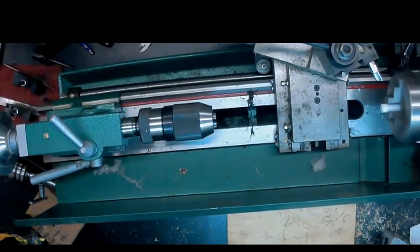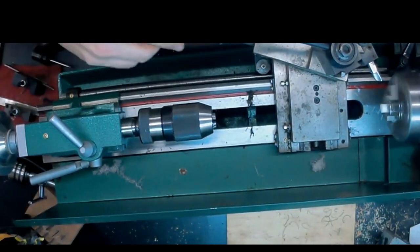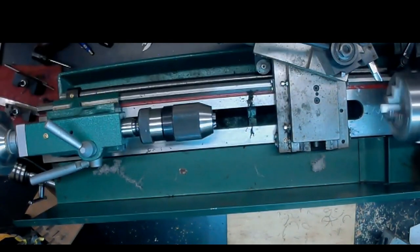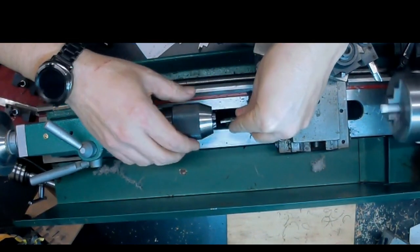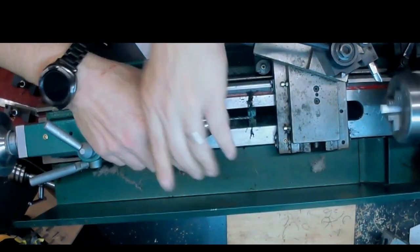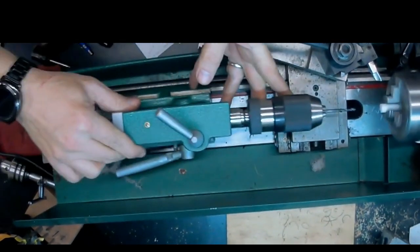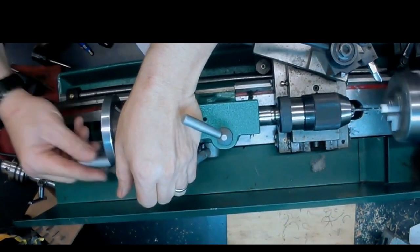And this is a fairly large hole, so we're not too worried about the size, you know, how deep we go. We're actually going to wind up chamfering this end anyway. And what I'm probably doing now is measuring the drill bit to make sure that I go deep enough, but it turns out the 1/8 inch drill bit is not long enough to get all the way through the tenon, and that's why I eventually will have to turn it around and drill from the other side.